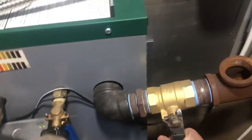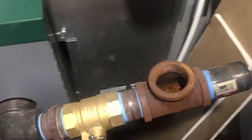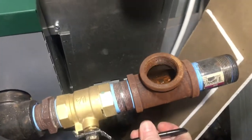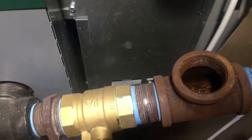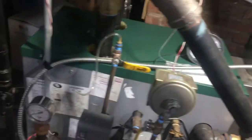I've got a drop header here, so we're not seeing anything happen up at the riser to the main — the drop header is doing its job. You can see the water's bouncing up about this high and that's about it — it's not really carrying over. I would expect a lot of steam boilers behave about this well depending on their water or if they're piped really low. You can expect some water could kind of come up, or if it's a Dunkirk style where the supply line comes off the side.